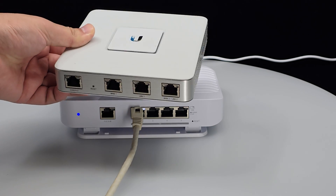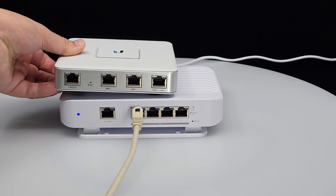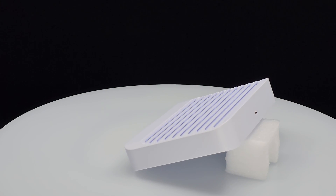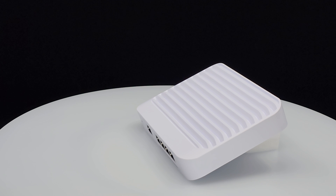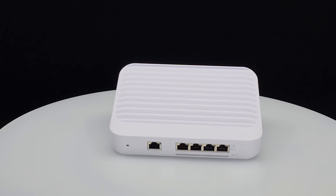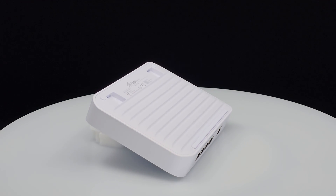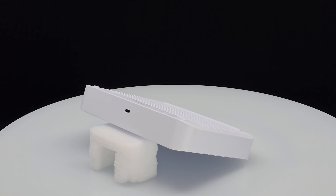The Flex XG is compact — here's a comparison of the Flex XG versus the previous UniFi Security Gateway or USG. It's also passively cooled and has the added benefit of silent operation. It achieves this thanks to the heatsink fins integrated into the device's shell, which work exceptionally well. Throughout testing and in continuous use, the Flex XG remained only mildly warm to the touch — nowhere near the heat generators of the SFP Plus RJ45 modules.